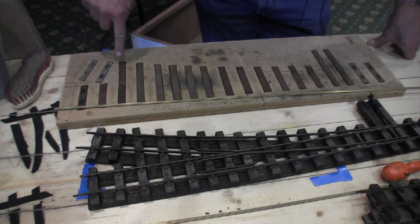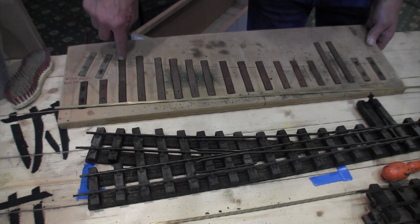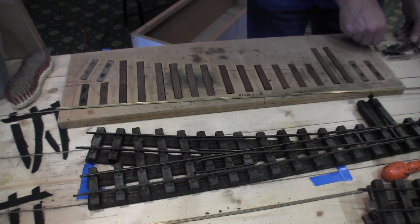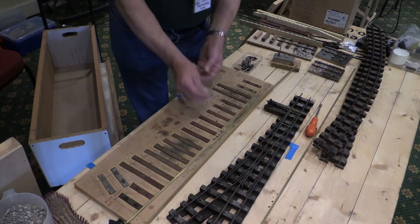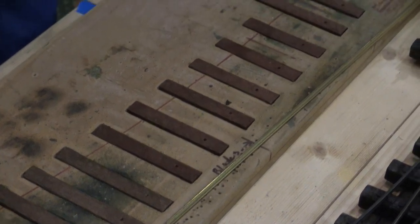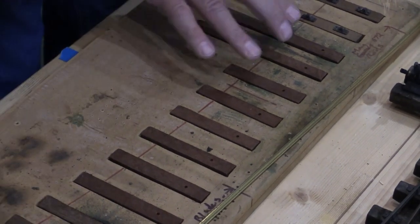Yeah, okay. With an automatic centre punch, if you can see, there's a red line, which is the line of the rail. Where it theoretically crosses, you put a centre punch mark, and you then drill those with these over here. This one's got a lot shorter because all this does is drill the depth of the hole. It's not going through a piece of metal. So that drills the holes around there. Again, you then glue in the relevant chairs. Again, you've got three there that are check rail, and those are slide rail.